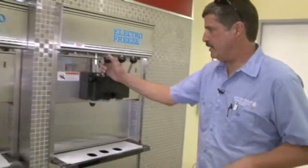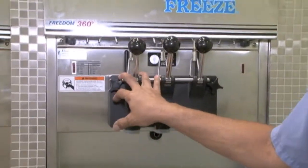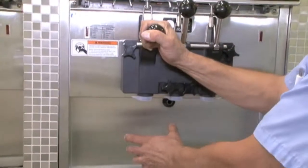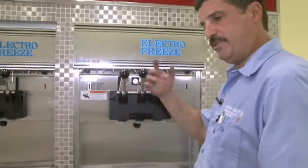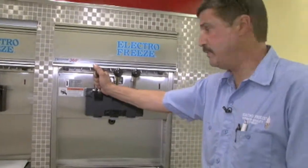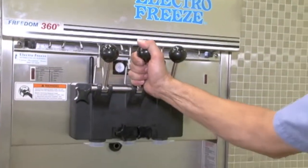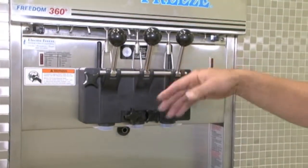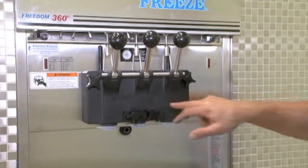As your customers pull the handles, there's a 12-second micro switch. So they pull this handle and the freezer's going to come on for 12 seconds. As they dispense the product and serve themselves, the freezer comes on and the pump comes on to replace that with liquid product. That 12 seconds is extra freeze time to refreeze the liquid that's come up to replace what they pulled out as a serving. If you pull the center handle, it controls both sides — that's your swirl handle. Pull that and both sides will come on for 12 seconds. You can actually walk up and pop this up, and that gives both sides 12 seconds of freezing.